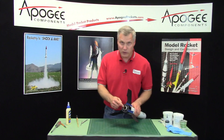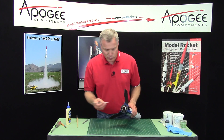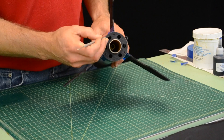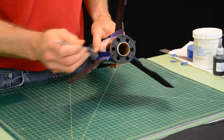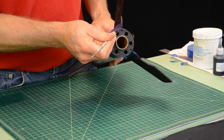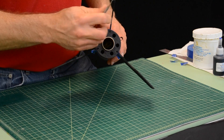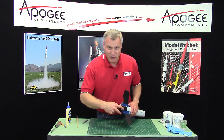You're probably wondering why there were center holes in the back end — that's so you can get inside with some kind of pick or a screwdriver and pull that centering ring back out. That was the main reason I put it in there. It also looks cool.